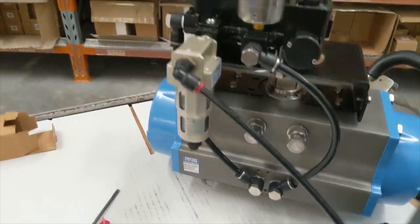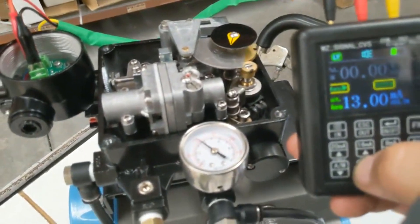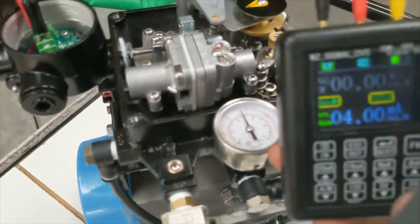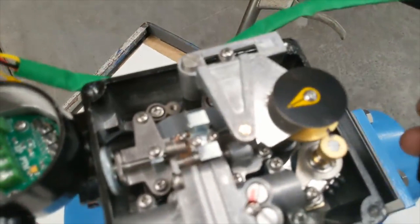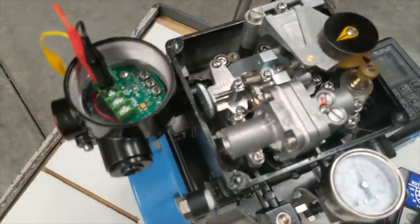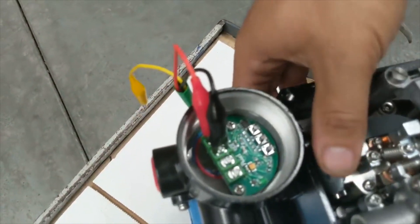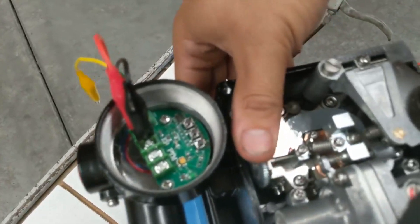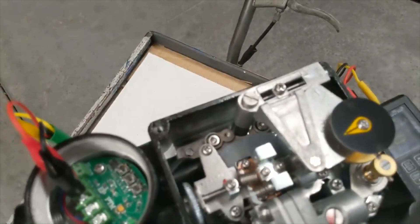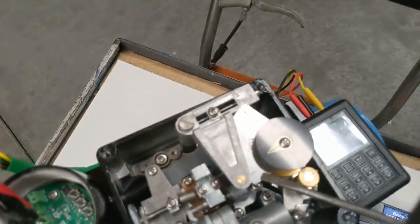That's the open position — it's turned 90 degrees. Now it shows four milliamp but on the indicator and on the cam it's not all the way home, so we need to adjust that. Just wind down the adjuster until the cam is sitting right on the zero mark.